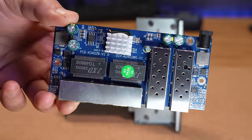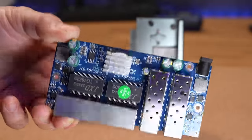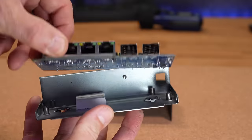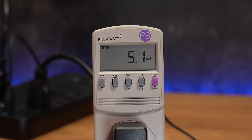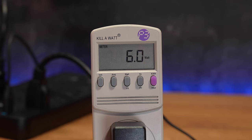As far as what's inside the metal box — take a few screws out — you can see the electronics are fairly packed in, and heat dissipation is assisted by the metal base of the switch. There's a thermal pad to help pull heat away, one heat sink, and obviously no fan, so silent operation is a bonus. As far as wattage goes, this is about a six-watt device with the SFP+ cages filled and a few devices plugged into the RJ45 ports — not much power draw at all.